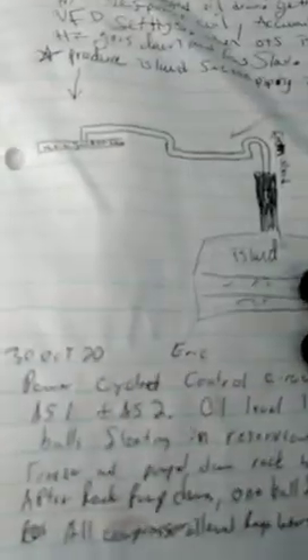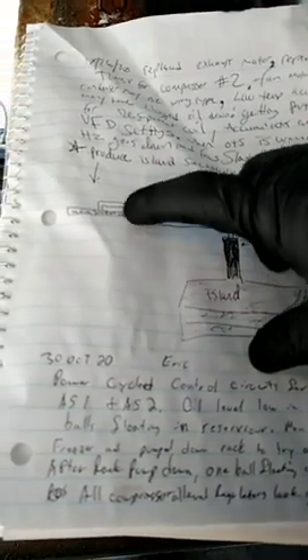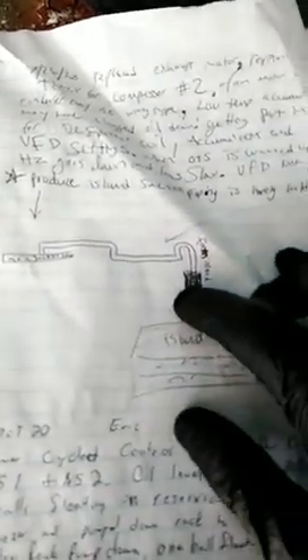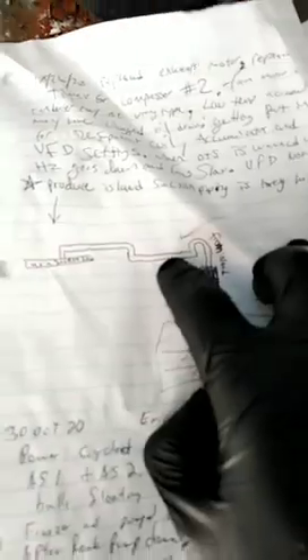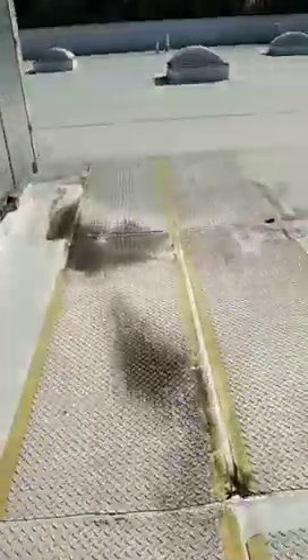That's the island they installed. They've got the riser coming up — this is in the ceiling — and the invert is trapped. From this point it should be pitched back towards the main suction and then drop down into the top. It drops down and then back up. So if there's not enough velocity from the medium temp side, this whole section of pipe, which is about 30 feet long, could be holding oil. I took pictures of the piping and sent it to Hill Phoenix — the tech support guy there kind of thinks the same way I do. That could be an oil trap.